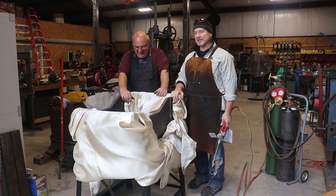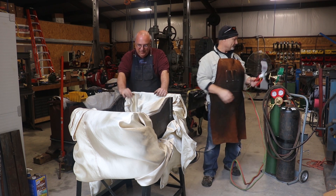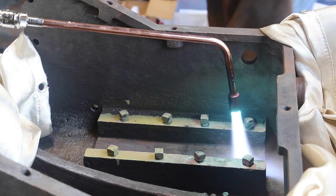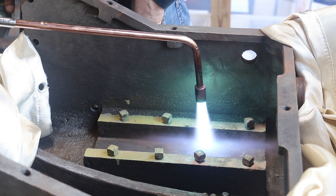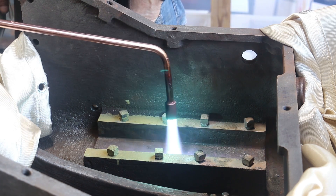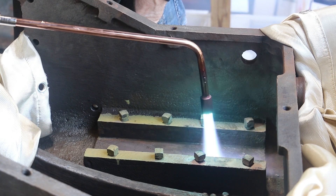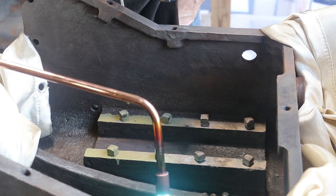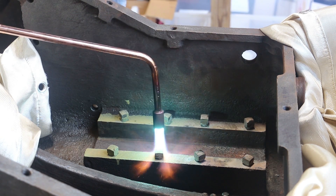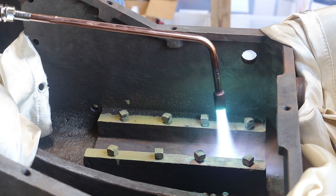This is a big job for me — this guy's used to heating up big cast iron pieces, I'm not. So I'll do little gears, but it'll be fun — it'll need a lot of heat. We're going to put some heat in here and I'll bring you back when we start welding. It's got the rosebud tip on there and putting heat into it. This rosebud really pours the heat in. We're already reading 640 degrees and we've only been at it maybe five minutes — not even that long. We had a smaller rosebud before and barely hit 600-something degrees with it.